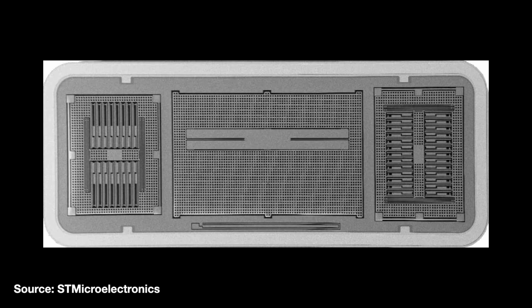For instance, deep reactive ion etching, which is an etch technique descended from reactive ion etch and the MEMS world. You know I love MEMS. MEMS artists wanted to cleanly, quickly produce complex geometries in the silicon, like deep holes, for something like a tether beam. Existing etch methods fell short because their holes were V-shaped.